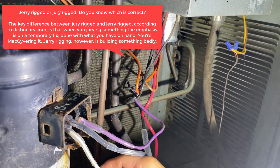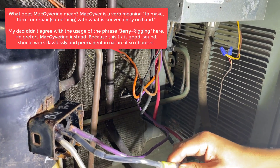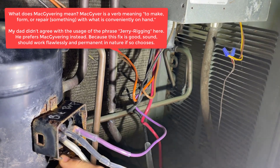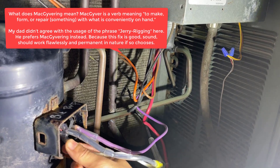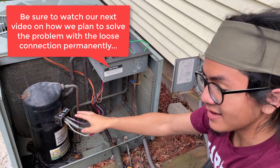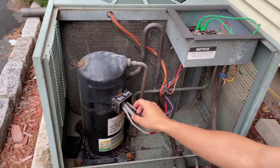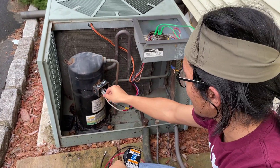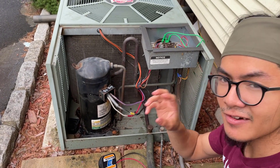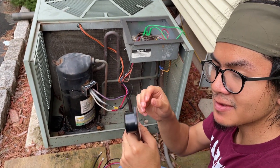This wire goes to this one, this one goes to this one. Maybe we'll come back later and replace it with something more robust. But as you can see right now, it seems like all of the connections are in there pretty solidly. Our problem with the compressor is that the contacts are corroded. That's the reason we had to jerry-rig everything and put shrink wrap on it — the contacts, called spade contacts, are corroded and not in the right shape to clamp on.